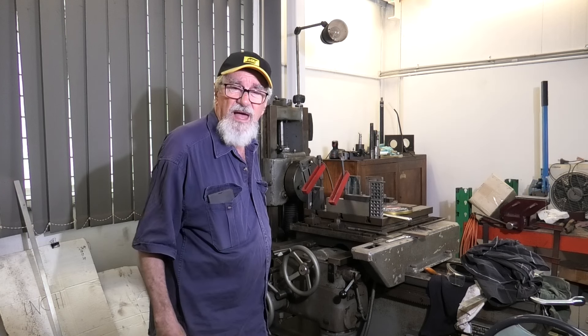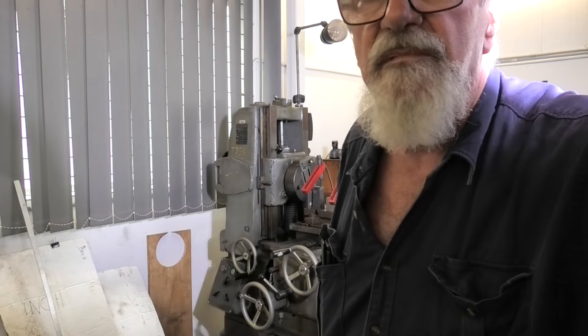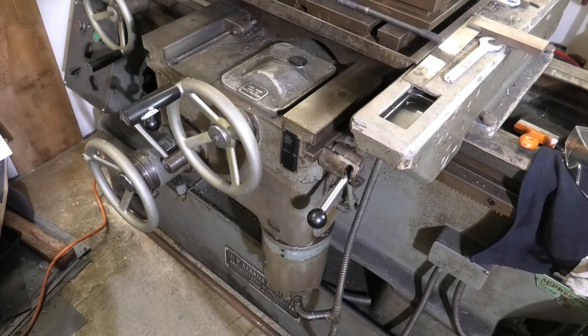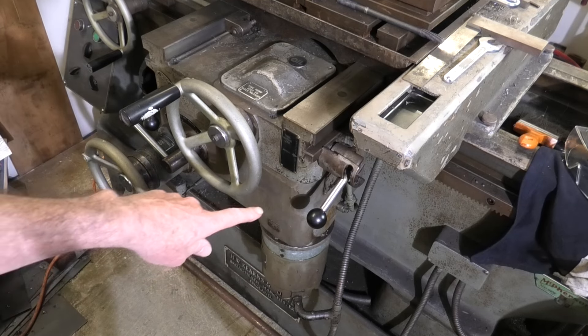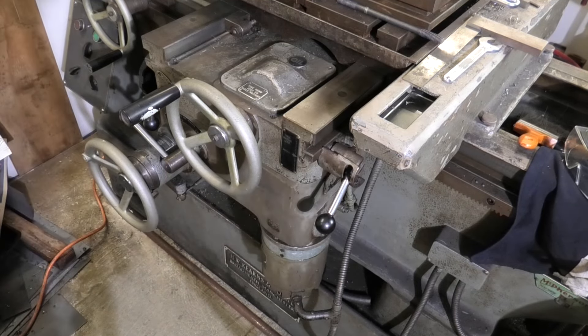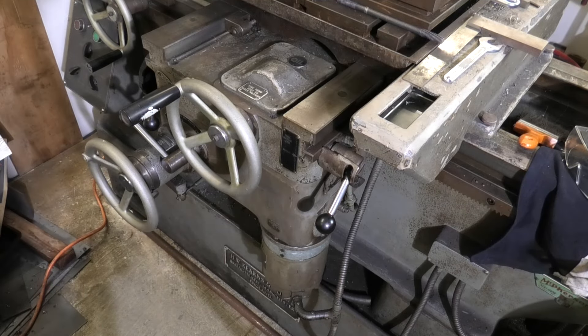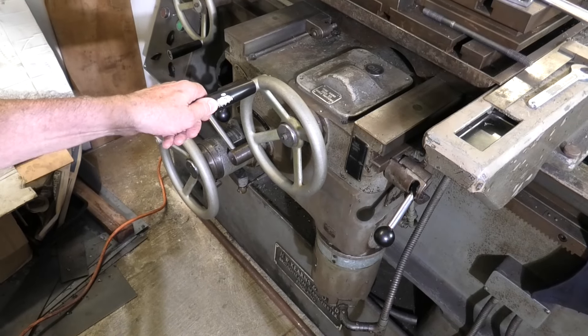Enough yapping for now — I'll bring you in a little bit closer and give you a better look at what this machine can do. Down the bottom here we have the electric motor to feed the table. And here we have a traverse or longitudinal lever — it just works a Morse cable down to a reverse selector on the gearbox. So you can feed the table crosswise or longitudinally, and here we have the manual feed for the table traverse.